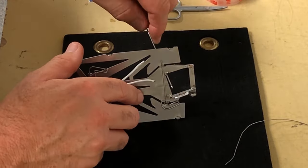We're going to go ahead and pre-tin the ends of these wires as well, right here away from the ESC. If you're not comfortable and you're afraid you're going to put a drop of solder right on the board, then just lay something over the board.